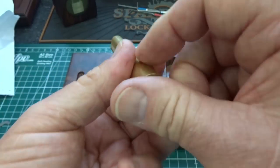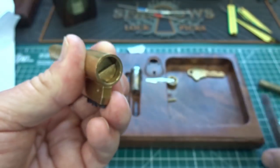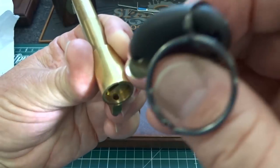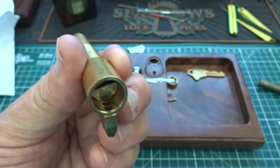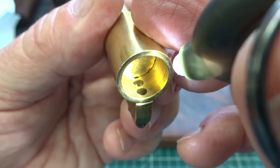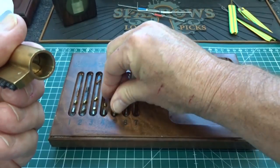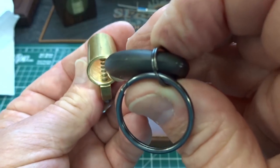Let's turn it around the other way to get some better light. Number six is the same thing — what's the deal here? We have a pin in number six but we have no spring. No spring at all. Number five — Lee, what are you doing to me? There is a pin in there but he is all the way down, like an eighth of an inch below the shear line. We have two pins in there — a wafer and then a T-pin — but no spring. Nothing. So gravity has got to work in your favor on this one.